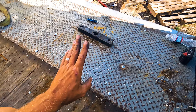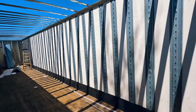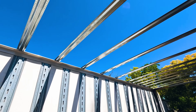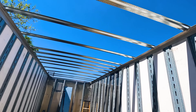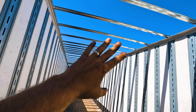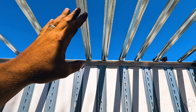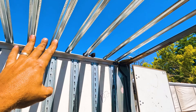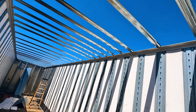A lot of people will argue that you're supposed to TIG weld the aluminum piece all the way down. The problem with TIG welding here is that this trailer vibrates and moves around a lot — the first three loads and that TIG weld is going to crack, 100% guaranteed. This is why you put a bunch of supports in instead. You can do it both ways, so prove me wrong in the comments.